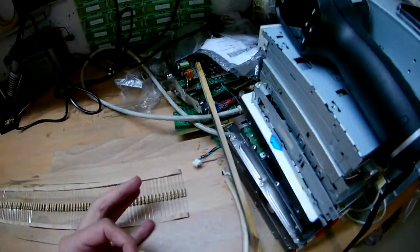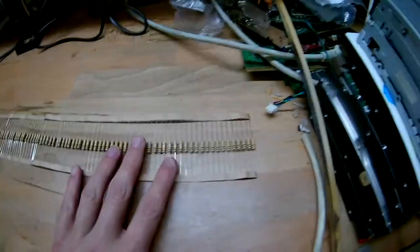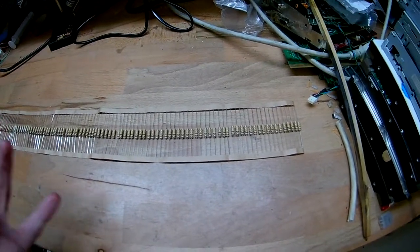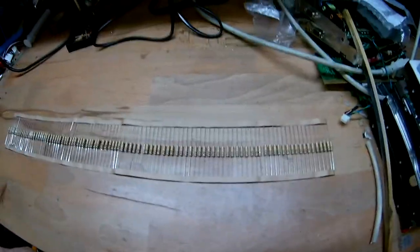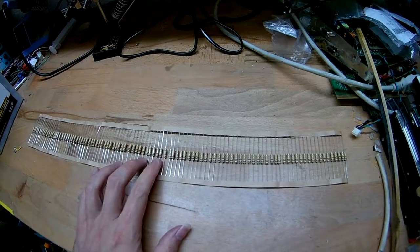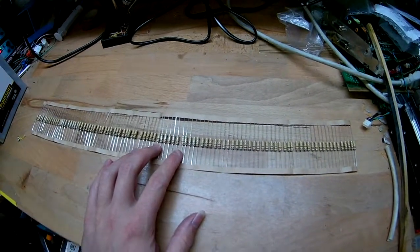Or I could just put one in there and it's gonna blow up again. I seriously don't know what to do. The one that was probably in there is rated 1 watt, yet there was like 200 watts flowing through it. The formula for power is I squared R, so one ampere times one ampere times one ohm is one watt. So with one amp flowing at 230 volts, that's a lot for not doing anything.